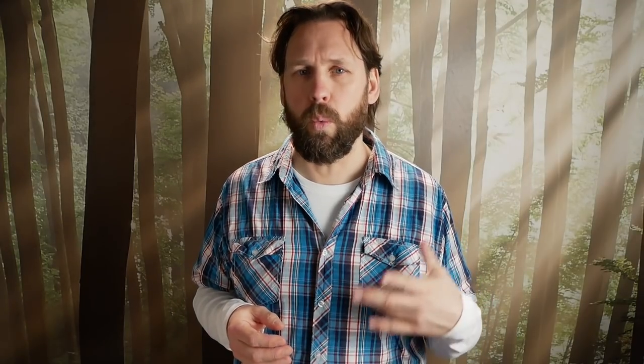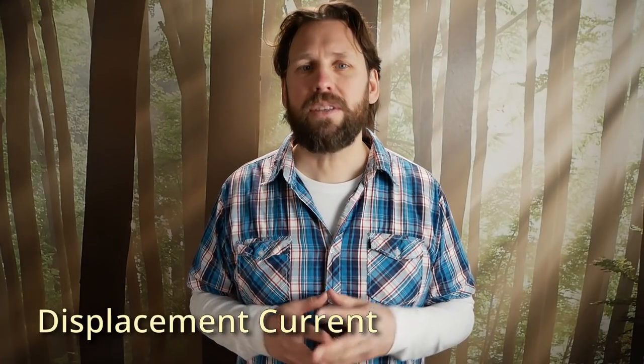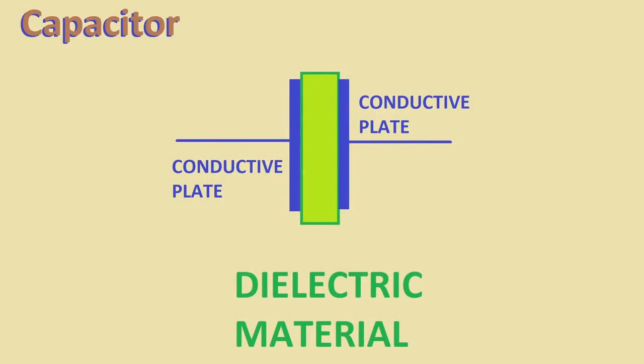There are two types of current. One is called conduction current, which is what flows when a lamp is connected to a battery by a conductive wire. The other type is called displacement current — its name was given by James Clerk Maxwell in 1861. Displacement current is mostly used to explain how a capacitor works. Between the two plates of a capacitor is a dielectric material, which we normally call an insulator. Pure water and nylon are also dielectric materials which can be used for a capacitor. A conduction current can't pass through this material, but a displacement current does flow through the dielectric material. Displacement current is not the same as conduction current — you could say it is a dielectric current, conducted through the dielectric material, through counter space.